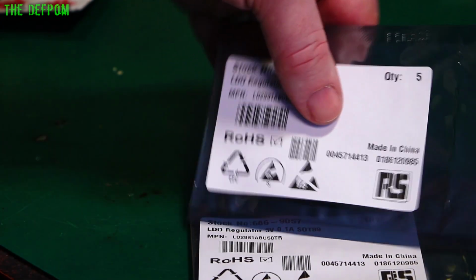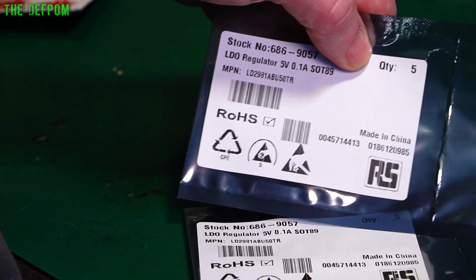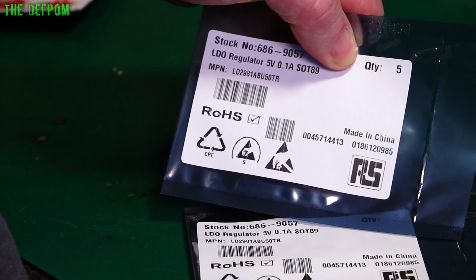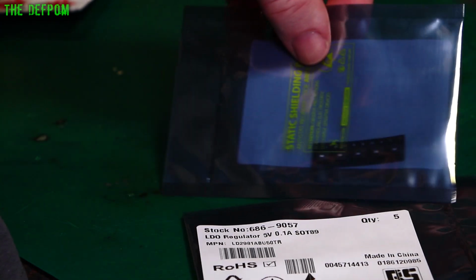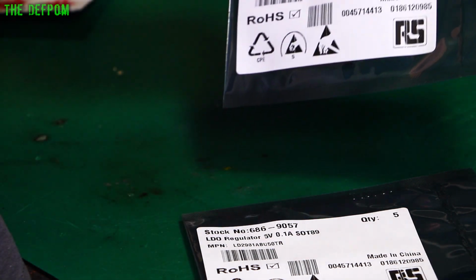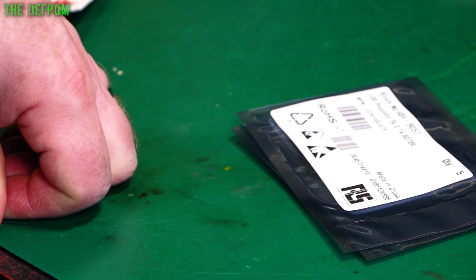I've had to modify the design to allow for a built-in voltage regulator, because when I did the build, which you would have seen maybe if you follow the other channel, I did the voltage divider build into the case and I put a 7805 regulator in, that sort of stuff. So I've actually modified the design, and that is now on the board itself. I've used a small device, SOT 89, because that's what it needs. It's really low current. And I think these were low dropouts as well. Yeah, these say so right there, LDO, low dropout regulators. That's good. More headroom. Excellent.